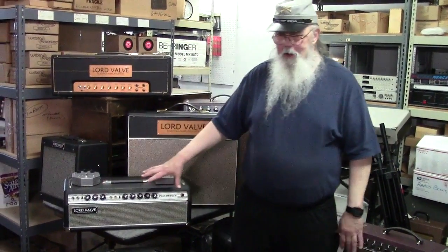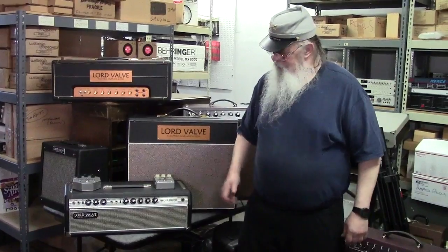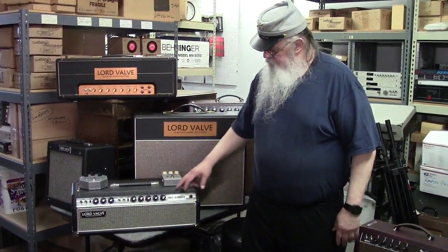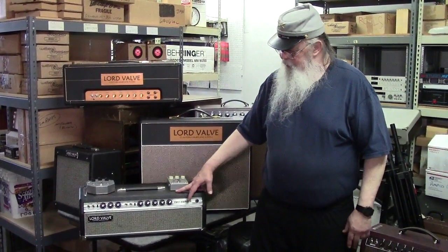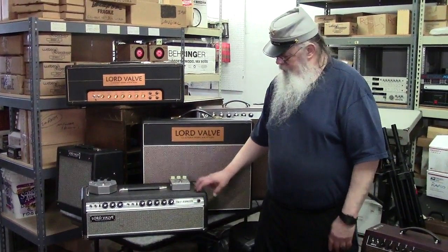What I built was a Super Reverb here with a Super Reverb output transformer and Super Reverb power transformer. Over here there's a Champ — two separate amplifiers in this head, completely separate. They both have their own standby switch, their own impedance switches, their own controls. They do share a power transformer, and there's a surprising degree of isolation between them — they don't interact very much. So two guys could play these two amplifiers into two different speakers at the same time. We ended up hooking the Super side, about 40 watts clean, into a Marshall 4x12 box, and the Champ side into a 2x10 box — set the Super side really clean, railed the Champ completely. The tone was amazing.